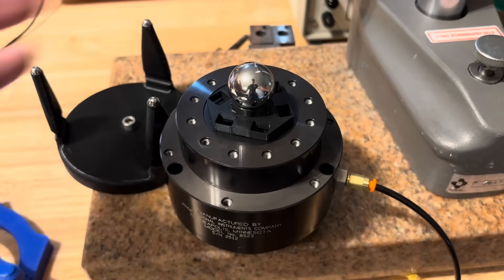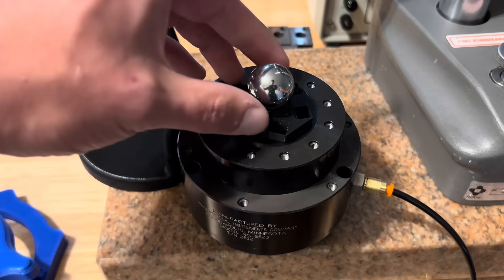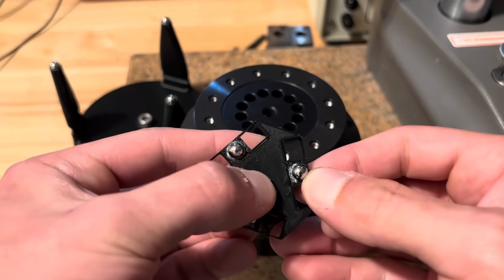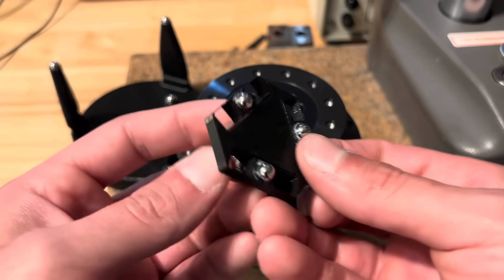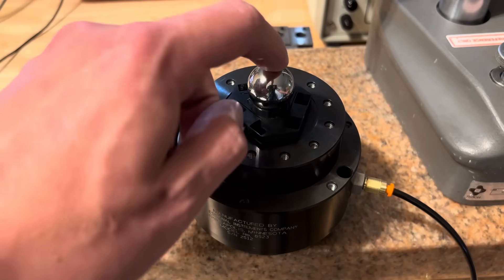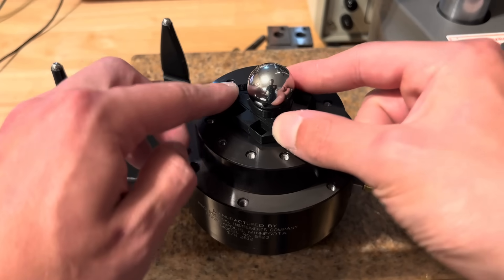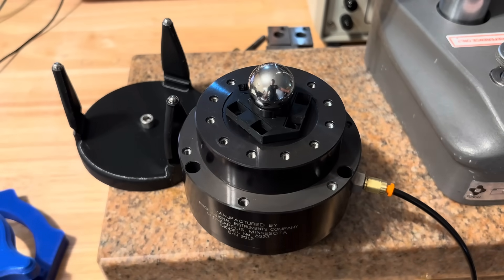It just pops down into the holes on the nose of the spindle. It's actually quite incredible and extremely satisfying, looking at how floppy these are. This really seems like you can never make a rigid connection with how loose these are. But then you put it down on there, and it just sits there — absolutely locked up. Rock solid. This does not want to move at all; there's no detectable flex. It's exactly constrained — that's the whole point.